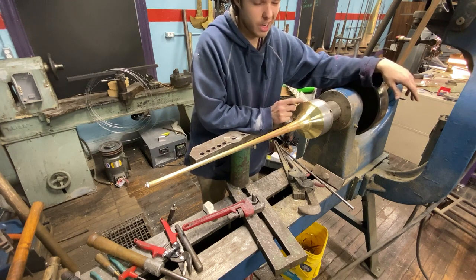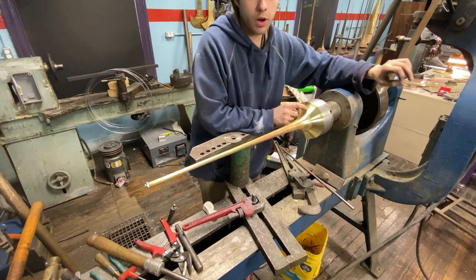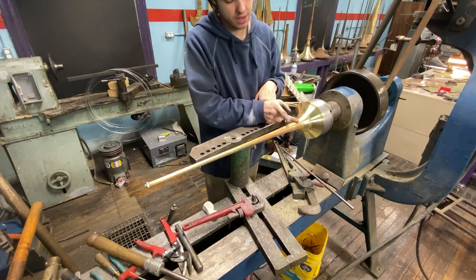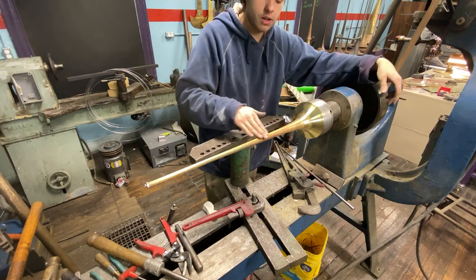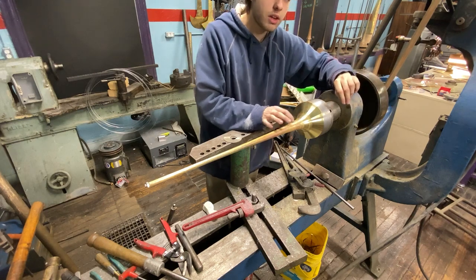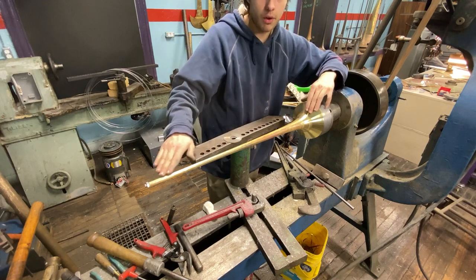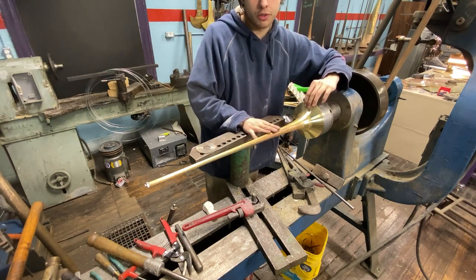Before you bead a bell, you have to make sure that seam is at the same thickness or less — preferably a couple thousandths less — than the bell material around it. I do that a few ways. I planish the seam about three times: before rolling, I hand hammer the seam at the flare about 20 hits to help it roll out better. Then I roll out the seam and check. You'll see little islands of braze that haven't rolled out perfectly — they look like cracks but they're not.